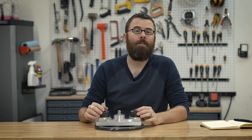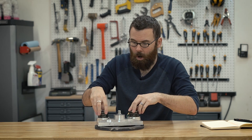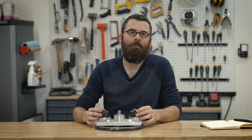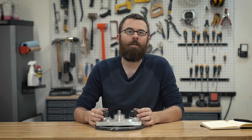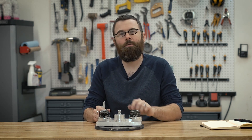This whole assembly as it stands is 12 pounds, which is actually 40% of the entire weight of the robot. The two motors here are PropDrive V2, 580 kV motors, about 2,000 watts. As you saw in the electronics video, they have a 190 amp — 200 amp peak — ESC on each of them.